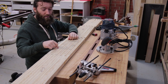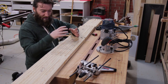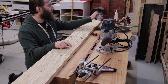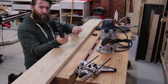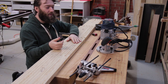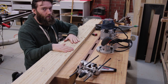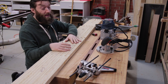Use a drill to start a pilot hole and then just use a jigsaw to cut it all out. Because I don't want that look — and it is all about the look — I am going to use a router to route to a depth of about 22mm for this fan, maybe 24. I'm going to route to that depth and then come back with a smaller bit from the other side and cut grooves along the length. Those grooves will sort of fall in line with how the plywood looks, so to me it will look more subtle while still providing airflow.